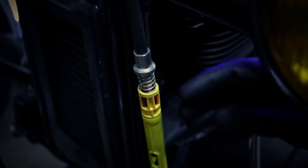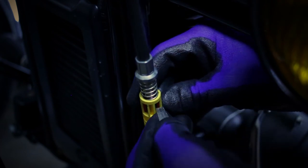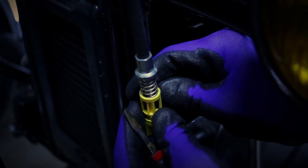To begin the process, all you need to do is release that little red plastic clip. You can do it with a flat-bladed screwdriver, or I found that I can usually just do it with my fingers. The idea is you wanna push the small ends of that red clip inward, and then push it away from the cable, and it should sort of snap out a little bit. It sticks out maybe 3/16ths of an inch once it's disengaged. And if you find that that little plastic button comes all the way out, it's okay — no big deal. You can just put it back in, it won't hurt anything.